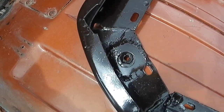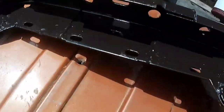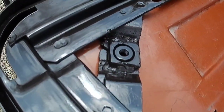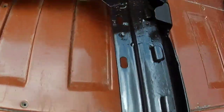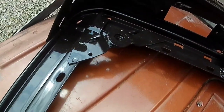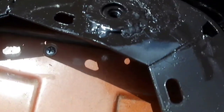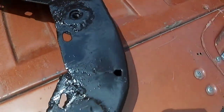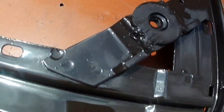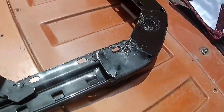Welded that up — that solved the problem. Here's the welding I did on it. I reinforced it, used some big washers, went around it, welded it all up, painted it. Reinforced it there, reinforced it there — some ugly welds all over it. More washers to reinforce it, some ugly welds. Straightened it out there, reinforced it there. Same thing there — some more ugly weld and another washer, both sides. Reinforced it there. Straightened it all up as best I can, gave it some rust paint and some regular paint.